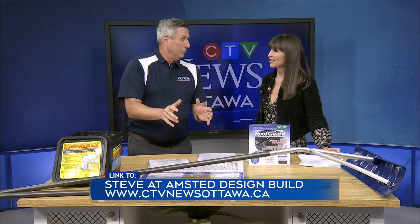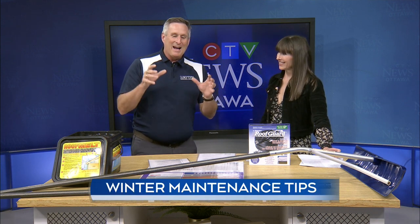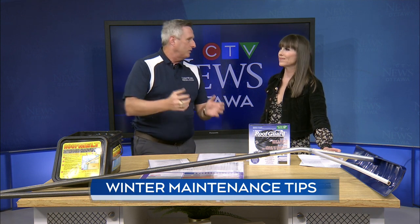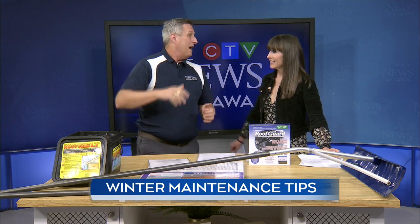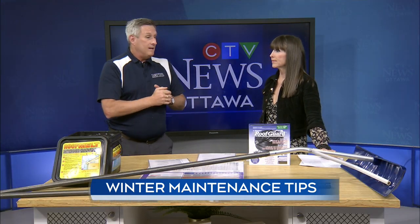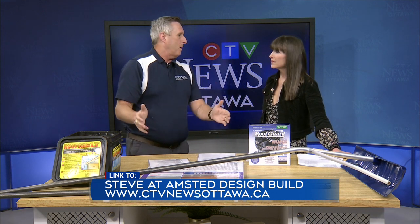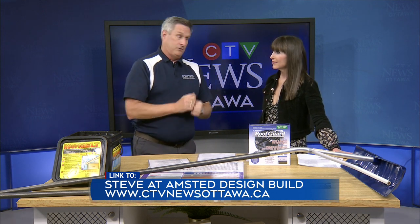Windows, we had the really cold Arctic vortex, I think Matt said, come down last time I was here, and we've got some more cold air coming. So just check the windows for air leakage, cold coming in, but also if there's any condensation on there, which we see in the older homes, and that just means we've got to get some more ventilation. So don't close your blinds or drapes, which everyone does because they're trying to keep the cold out. Leave those open so that the air can get to them and dry those windows out. And are you a fan of weather stripping? Weather stripping? Yeah, I think weather stripping is a Band-Aid for something that wasn't installed properly or maybe is a little bit older, but it's a great Band-Aid.